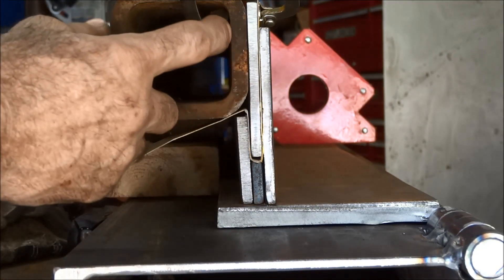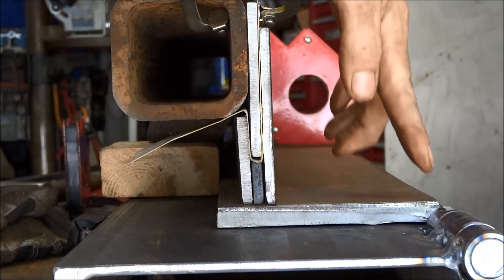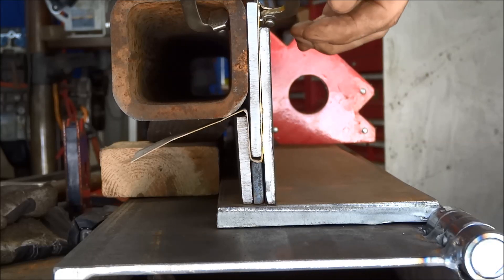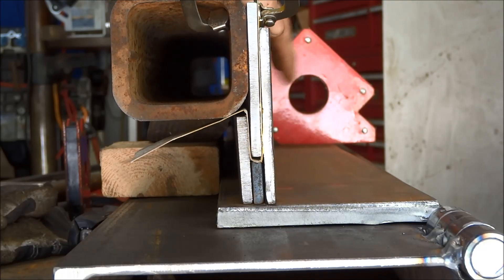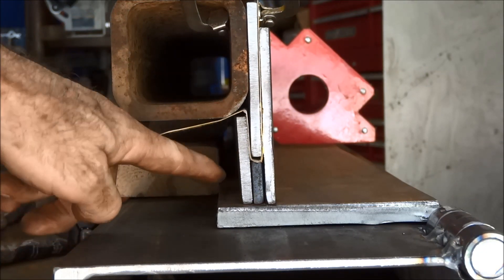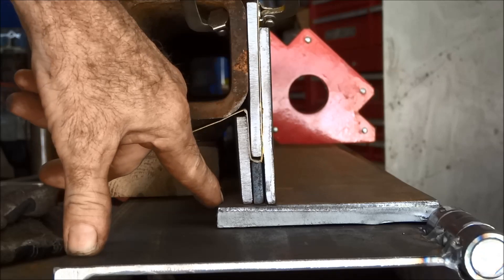This is the idea — this is basically going to be the main bar of the brake. Everything below the cardboard is going to be welded together to make the fingers. That's going to have to be ground off to a 45 to be able to do more than a 90-degree bend. There'll be a clamp bar above this to hold the fingers in place. I'll probably put gussets in here to give it more support. I believe it'll be strong enough so I may just go straight right down to the edge.